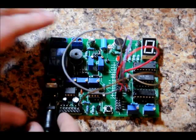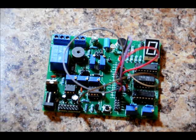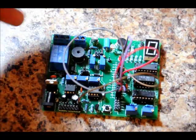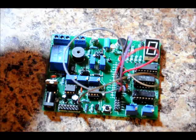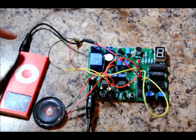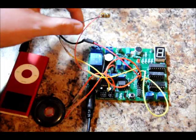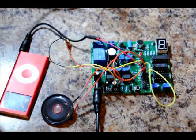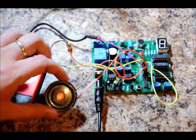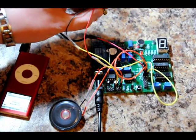Let's try one more circuit — let's modulate sound coming from our iPod through our light sensor. Let's amplify it and see if we can send audio from our iPod through our laser to our LDR, to be received, amplified, and put through a speaker. What happens is we amplify an audio signal coming from my iPod — 'Light My Fire' by The Doors. It's being received by an LDR. You can tune it very carefully.